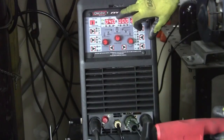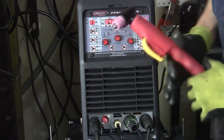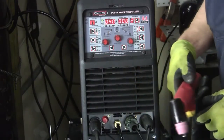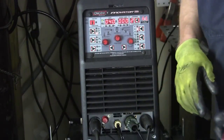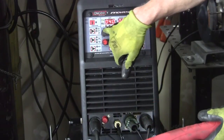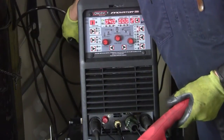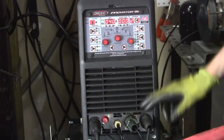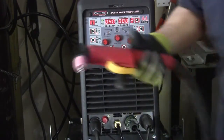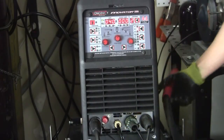And I'm already set up for my amp, my 40 amp. And my aluminum, actually, it's 3/4 of an inch thick. And so I'll have to go a little slower. And I'm not going to use a burning bar. And I'll show you what I'm going to do there. But we're all good, because we're set at our plasma with the 40 amps. I got my air line, and I'm going about 100 PSI on that. And we're all good here with our leads and our grounds. And so yeah, let's go over to the plate and we'll weld that up, or cut that up, I'm sorry.